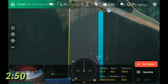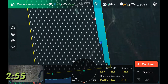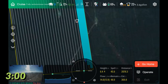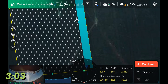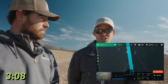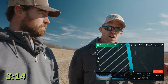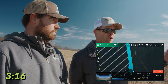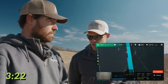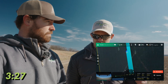The drone is going to make it down to the end of the field and then slide over. You can see the empty tank icon right there — so it's going to go down, back down again, and then partially back before it runs out. True efficiency is when you can match your tank volume and swath width to your field length so it goes down-back and it's empty — here we have a down-back-down and about a third of the way back, then we're empty.